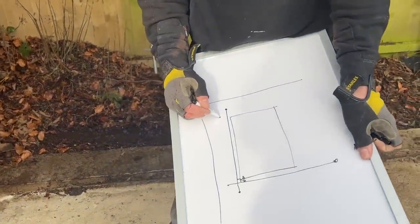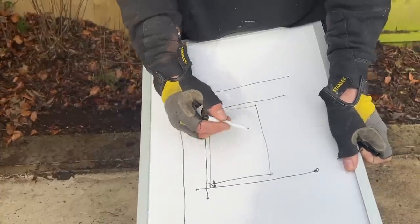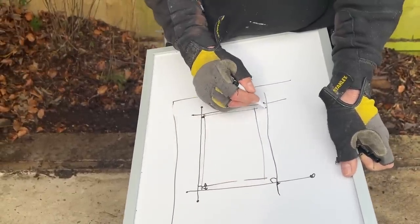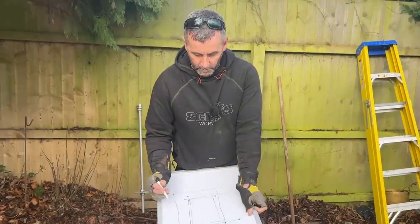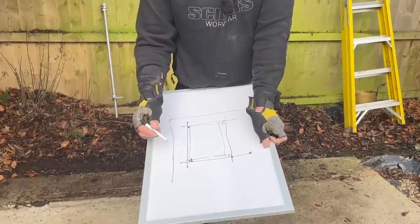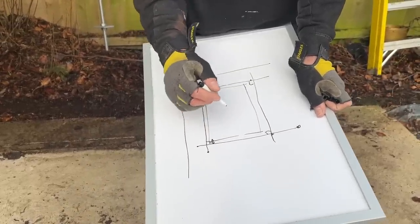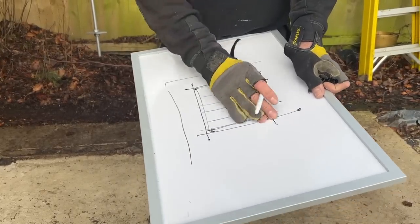When he's done that one, he'll put another line there and ping it like that. Again, he'll put the square on there and make that square, then we'll measure 3.1 that way. He'll pull the line down there and check it's square as well. If they're not completely square, it's not the end of the world — we like to get within 20mm at least. And a square frame means that when you cut your roof timbers, they're all the same length.